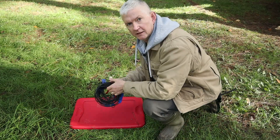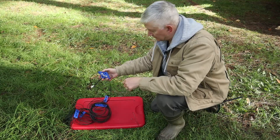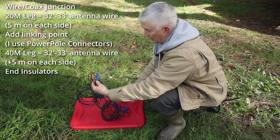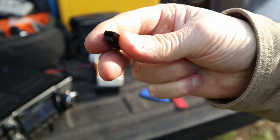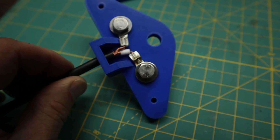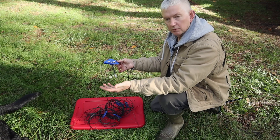This next antenna is a linked dipole antenna — a little more complex, but not too bad. This antenna uses the same idea: you have your antenna wire cut to 20 meters, and then you add additional wire that allows you to go to 40 meters. You link that — in my case I'm using some power pole connectors — and then you have a way to link these wires together. For the junction, I again made another copy of my center piece, used a piece of coax with a crimping tool for a BNC connector, and soldered everything together. Lots of options.